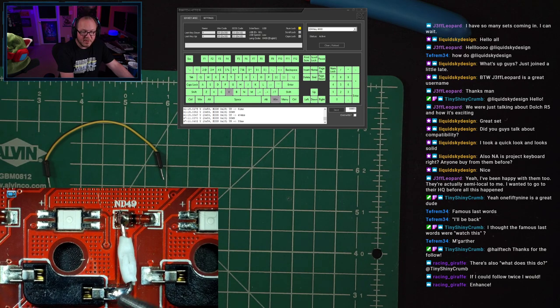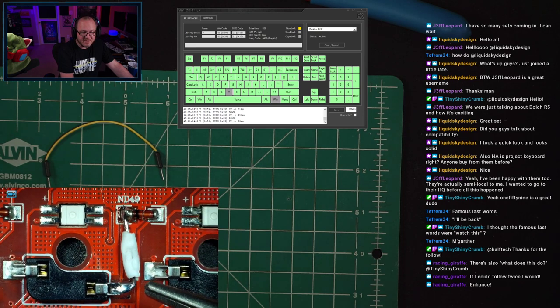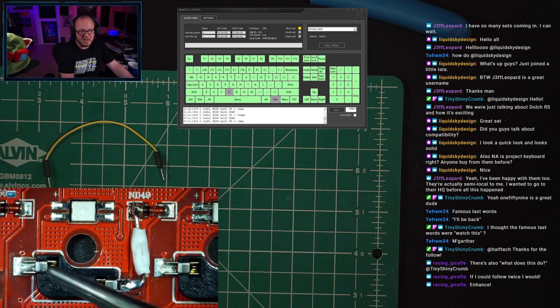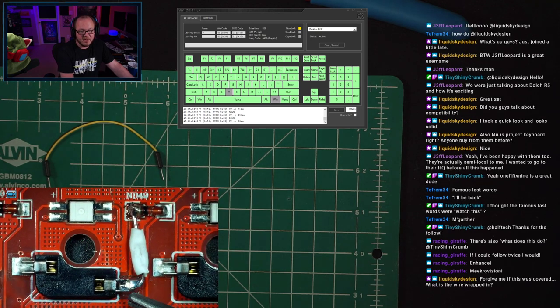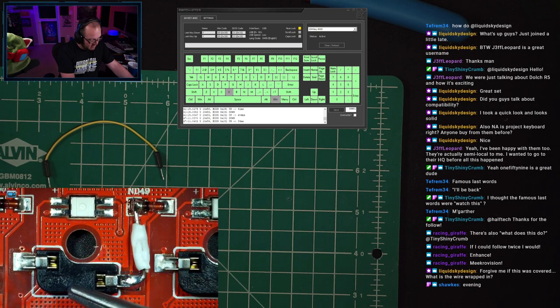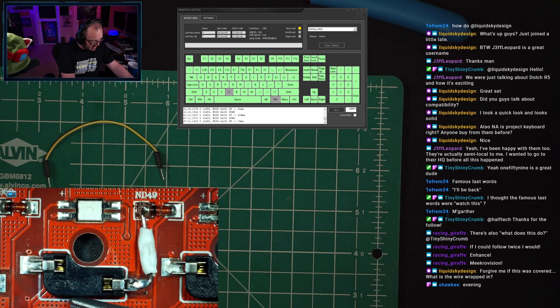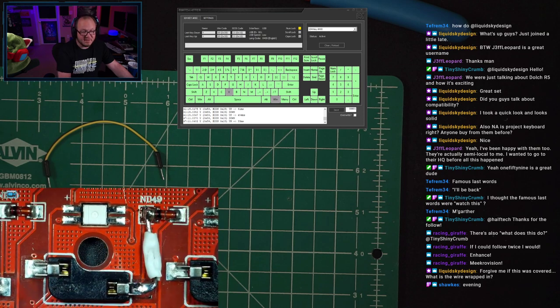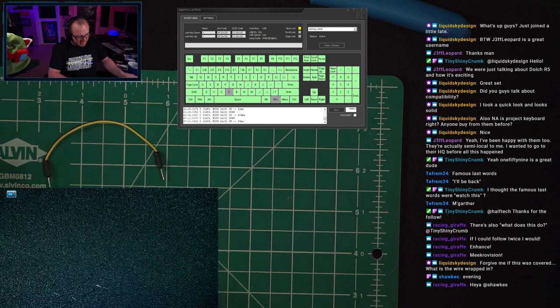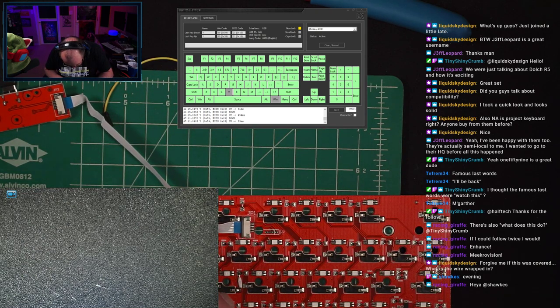right here, we flowed our joint. We flowed our joint right there. Because we pre-tinned everything, everything flowed right together pretty well, right? So now, this side is delaminated. So we're gonna glue under that pad because it's still a little loose, if I'm not mistaken. Ooh, it's not loose. Did the right one, right? We did. Well, it does not appear to be loose now. Which is kind of scary a little bit. So there must have been part of that trace that was still there.